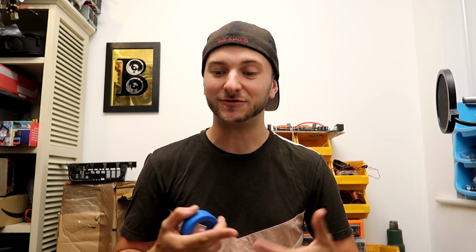Now, I was going to use Litz wire. Remember from the first video? Anthony recommended we use Litz wire for a bunch of reasons, and I can change the switching frequency of the power supply FETs and make it super high power density. But man, finding Litz wire in the UK at least is freaking impossible. You've either got to buy it in like 10 or 50, 100 kilogram bulk orders, or it's just very complicated how you got to buy it.